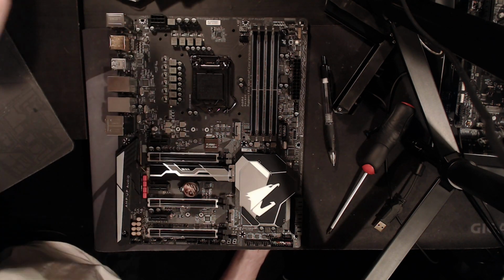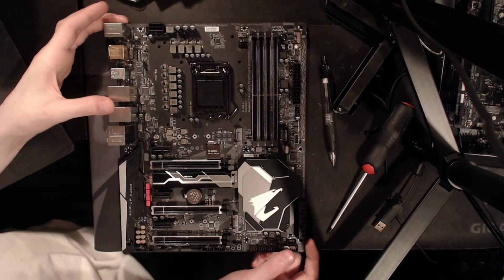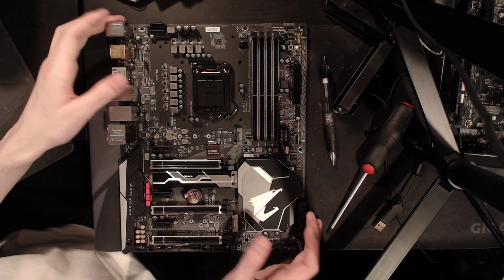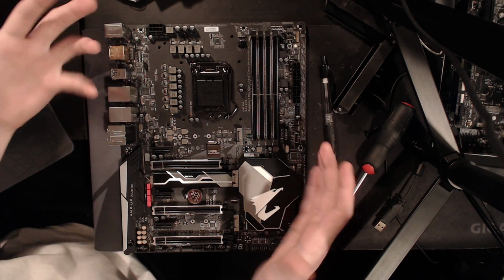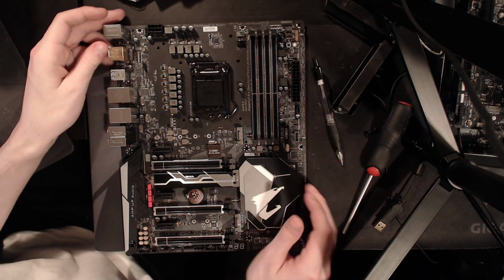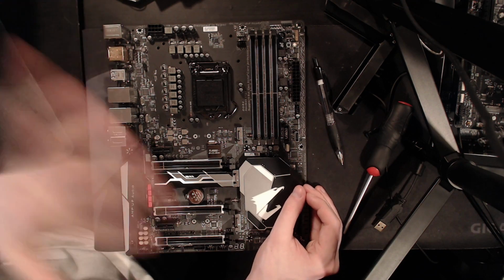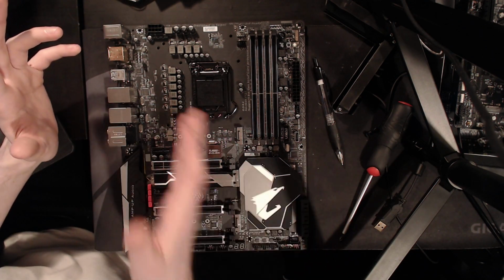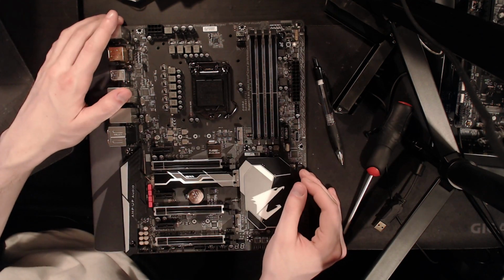If you're doing 3D modeling and rendering, that's very similar, especially since the latest version of Blender uses AVX acceleration, and it also depends on what rendering engine you use. If you have one that uses AVX acceleration, it can get very close in power consumption to what Prime 95 does. But even under those workloads, you're still looking at around 140, 150 amps V-core VRM output, so that's about 1/4 the total output capacity of the VRM.